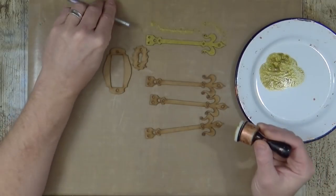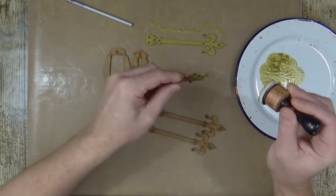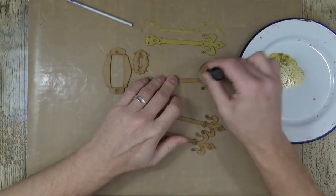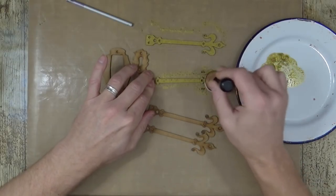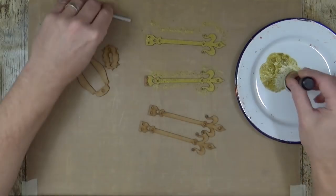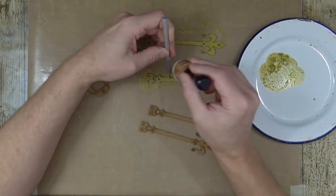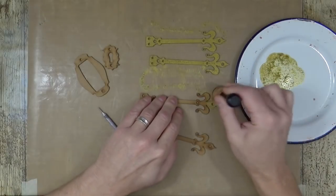By using the spouncer you get a lovely hammered texture — almost like a hammered finish. When you spounce it, the paint doesn't go down the sides as much, so you don't have to worry about painting the sides. You haven't had to use a primer either, which is a good thing about MDF — or rather medite — as they call it.